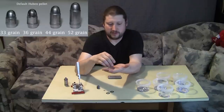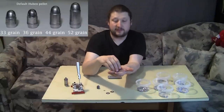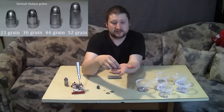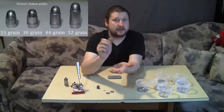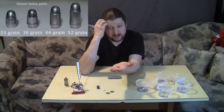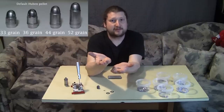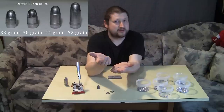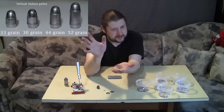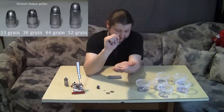You're probably asking yourself why you'd want to do this. Huben doesn't accept anything bigger than 11 millimeters in pellet length, so I can't use those bigger slugs in the Huben. But I have other air guns — a topic for another video — that do fit them and work quite well. With the Wolverine I'm shooting the 52-grain at 292 meters per second, that's about 145 joules — I think about 105 or 110 foot-pounds — in 5.5 caliber, so 22 caliber.